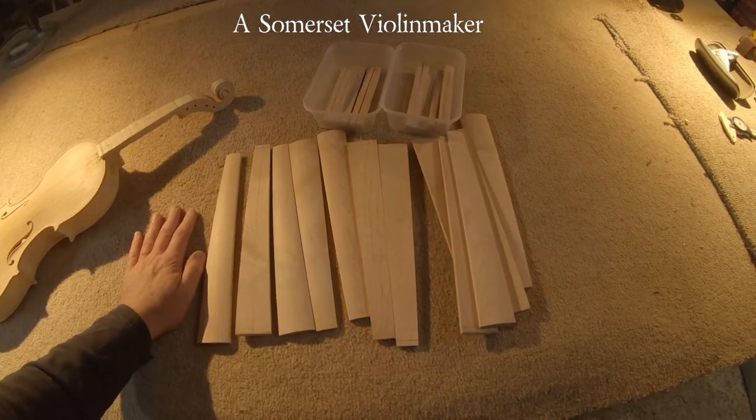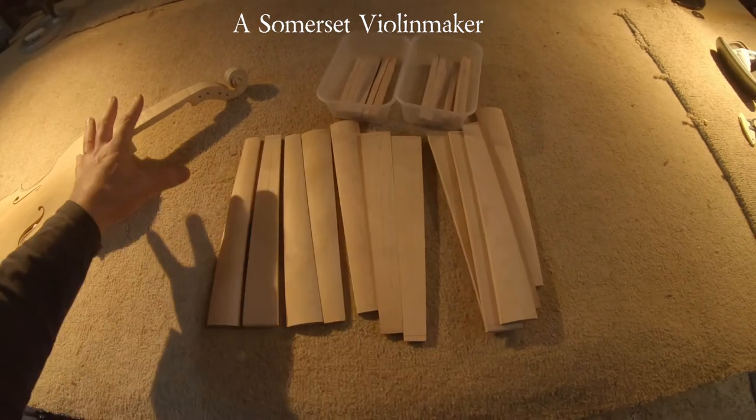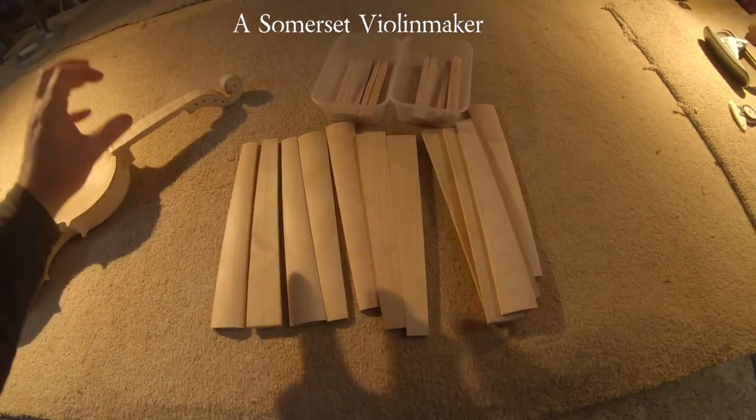The other thinking is I get them worked up and fitted, but before I do the final fitting and gluing, then stain them. So I leave them in the state of raw maple up until the time when they're ready to fit, and then stain them with India ink. Another alternative, which I know some people have used with some success, is to impregnate the surface with cyanoacrylate — that is to say superglue.